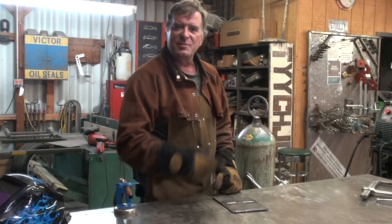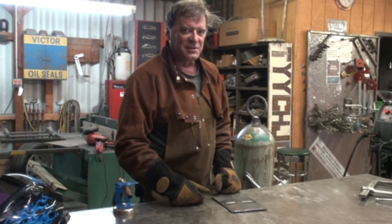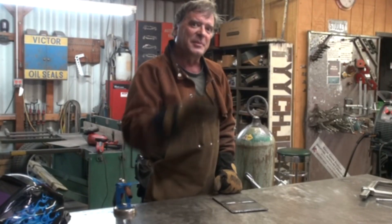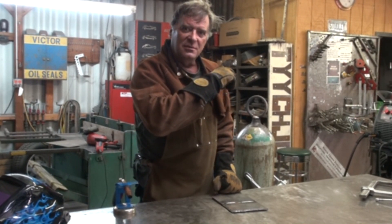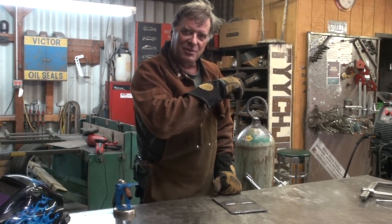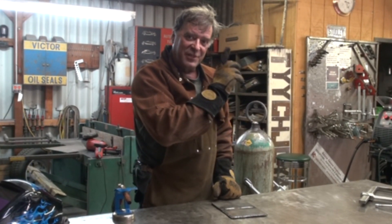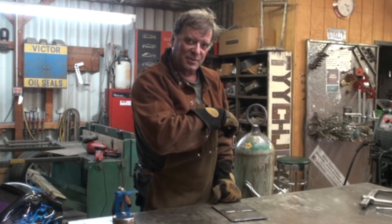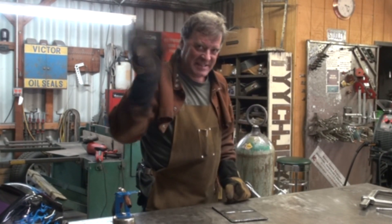Sweet! A good, strong machine. I think I'm going to have fun getting to know this one more and putting it to work — getting some bigger plate in here and doing stuff with it. I've also got this little 16-gauge I'm working on over here. We'll be able to turn it all the way down. That's a 110-volt machine — 110 or 220. In 110 volts you've got 25 volts on the MIG. In 220, you've got 30 volts available at the MIG. And you're looking at about a $2,100 machine. I'm going to have fun playing with this. It's hot here — we'll see you next time.